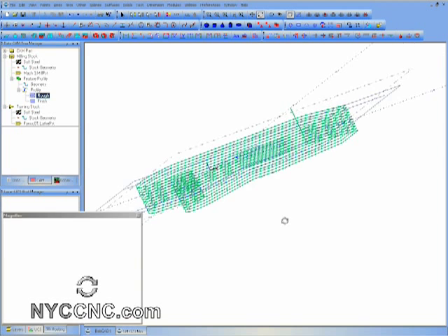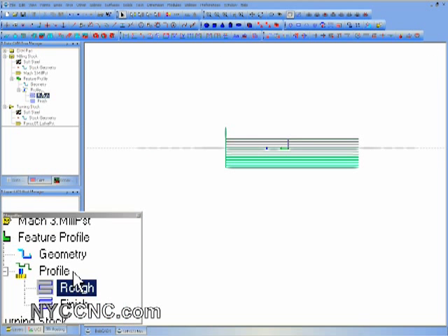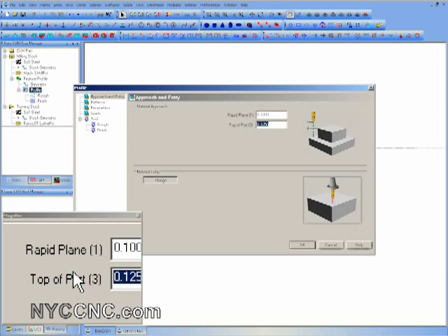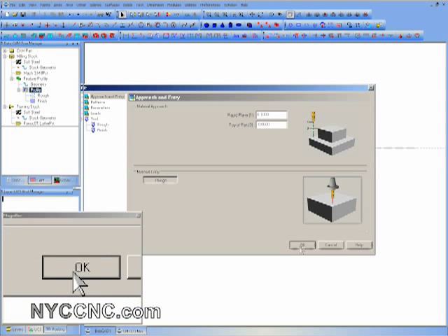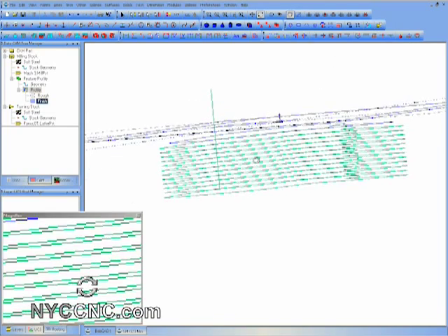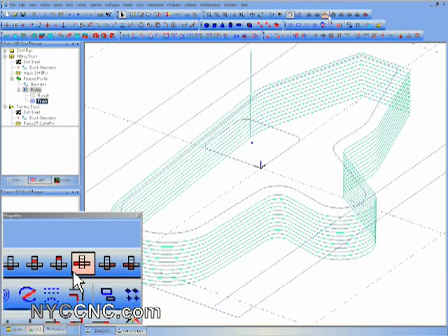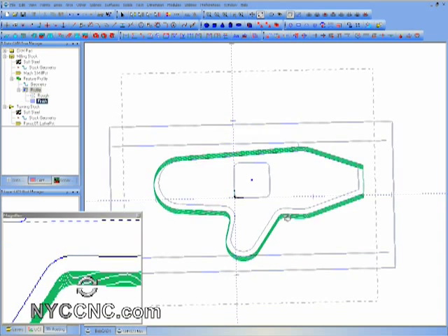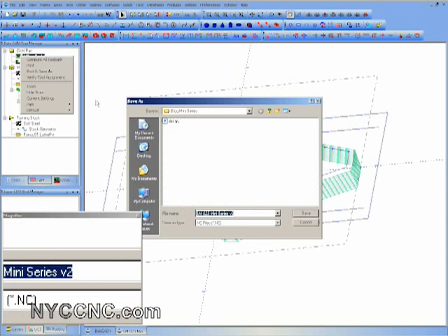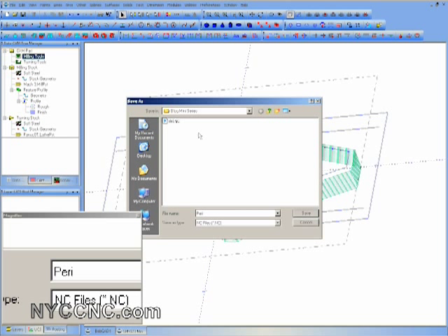Pretty small, pretty light passes. You'll see coming up that I do make a mistake — the cutting depth is appropriate but the part gets too hot, causing chip welding, so we'll need to address that in the future. The top of the part was left and the top is actually a little bit below. I've now confirmed that the green CAM lines are where they need to be — slightly below — because I'm going to zero off the top of the part, which is 0.06 inches above the plane I'm working in right now. We'll get to the chip welding problem in a second.